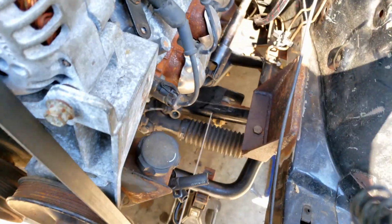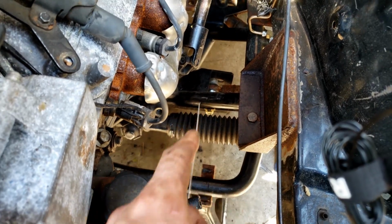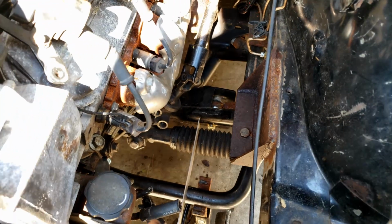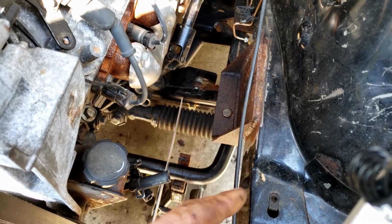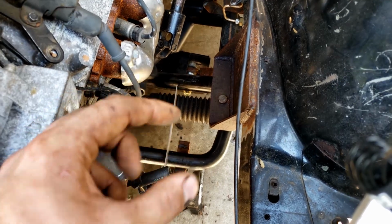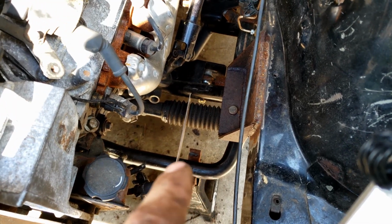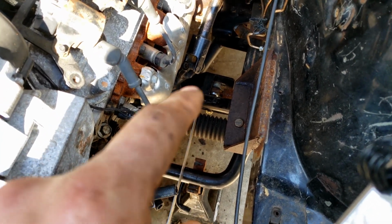So the simplest thing that I'm thinking here to make this happen is I'm probably going to come off of this bar on the K-member, come straight forward with a piece of steel, whether it be the box tubing or round tube, I haven't decided yet. So basically come straight off of that, and then it's going to kick up from there up over to here. So basically have another plate like this one welded here with a nut and bolt somehow on it. I still have to figure out how I'm going to do this. So it'll come down at an angle, it'll meet right about here, and then it'll shoot back to there, and then the sway bar will hang off the bottom of that, because I can't take this support all the way across like I'd wanted to, because there's just not that much room. So let me go ahead and start working on a piece to put in here, and then we'll see how well that works.